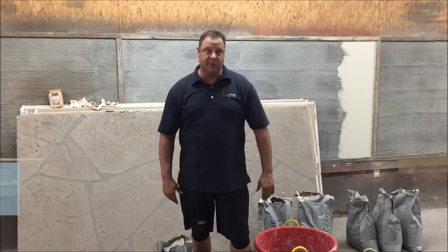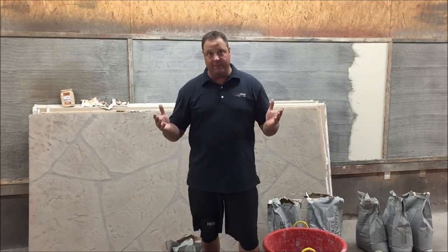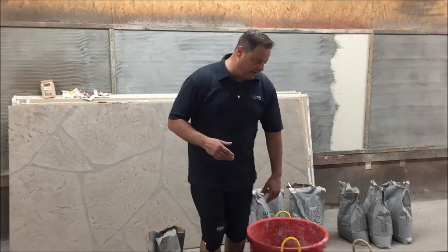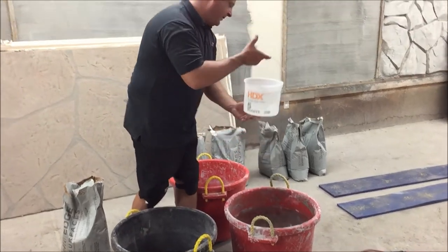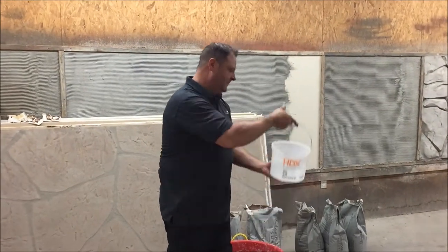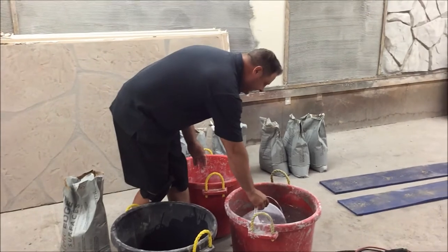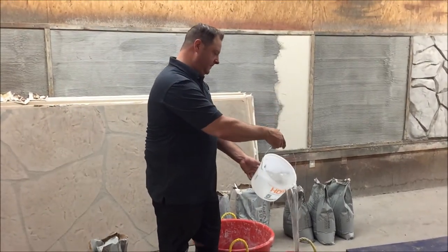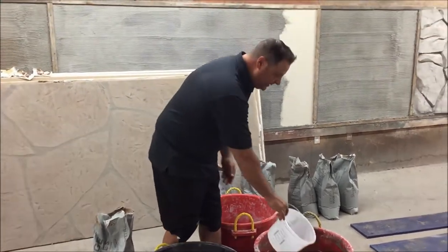So we're going to mix up our Pro Stamp from Stone Edge Materials now. I'm going to mix two-bag batches at a time. If you're a one-man show, you can be down towards 2.75 quarts per bag. We're going to be a little stronger than that and work our way to consistency depending on hard or soft water. So I'm going to put three quarts per bag — I'm going to a two-bag batch, and I'll start mixing, then show you how we work our way to consistency not exceeding 3.75 quarts.